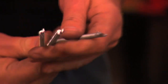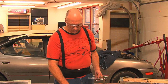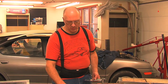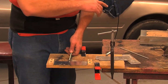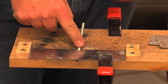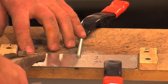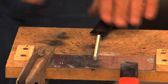Now I've got three half-moons cut. They'll sit nicely on the plate and I can weld them in place. I've built a little jig here that does two things: one is it keeps the rod perpendicular to the plate, and the other is that it makes sure all the plates are lined up the same where the rod comes off, so when I put them in the tray all the rods will line up. I start out with the plate, clamp the plate in, put the rod in — you'll notice it overlaps about half an inch — clamp the rod down, and use the grounding clamp from the welder to clamp the other side. I check everything is lined up right and then weld it.